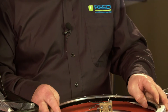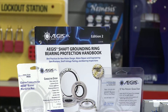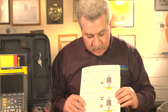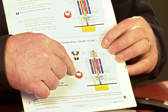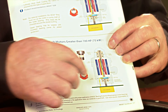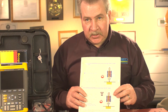The Aegis brush design can be utilized inside of a motor. If we're going to use this process in a vertical motor, this is the one I would recommend — where you're actually insulating the bearing carrier for the thrust bearings, and then installing the Aegis grounding brush assembly inside the bottom of the bearing cap at the bottom of the motor, shunting any current or voltage past the bearing before it gets to the lower bearing. By insulating that and having it flow through down to the framework, this works real well and eliminates about 90% of the current.